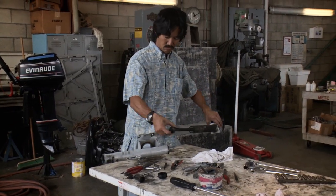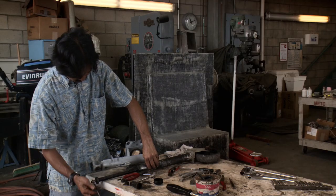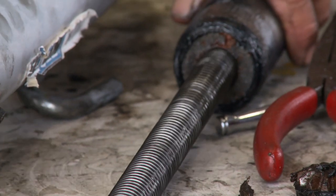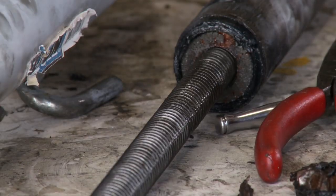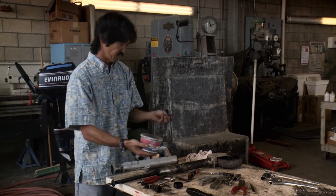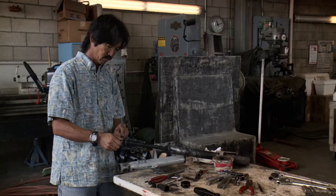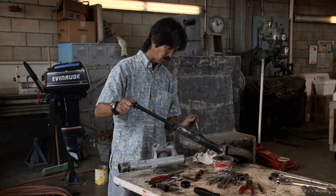And that's basically it. I'm going to sit down and extend this and basically just re-service it, re-grease it. A lot of times the factory will not pay a lot of attention to greasing these items. Some of them probably don't suspect that it goes in salt water at all. So I just generally give it a very generous helping of grease. Put some on the shaft as well.